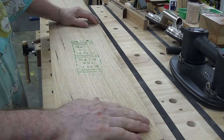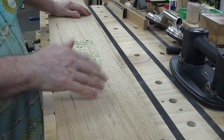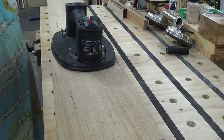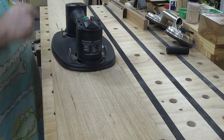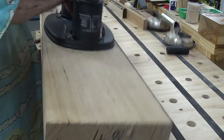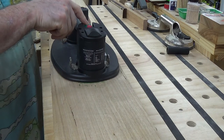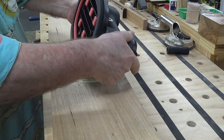Here I am with the piece of wood. It's really fairly rough grain, as in it hasn't been dressed properly — probably straight off the saw or whatever. Slap this on, press the button. Straight away it's going to come up to maximum. It's still sucking through the grain but — as you can see — you'll hear it cut out and cut in. That's because as soon as it loses pressure it'll keep going again. I won't overtax it — release it — but the whole idea of this is it's a vacuum clamp, much like my expensive Festool Sysvac.